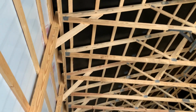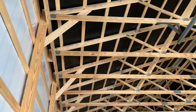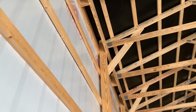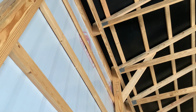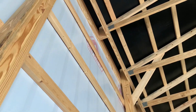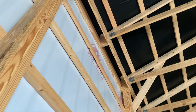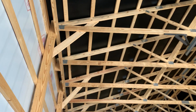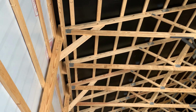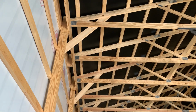You can see how those purlins are laying flat there. All right, but you can see how we do it. We notch it right there on the post, but when the trusses go in between the posts, we put that 2x6 and we notch in to secure that as well. All right, 4 foot on center. Again, we can put the purlins flat. That way we don't have issues as far as nailing the screw. We just have more diameter when we're tacking in that screw.